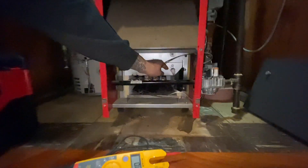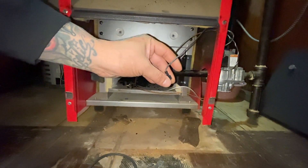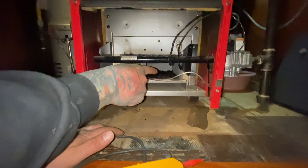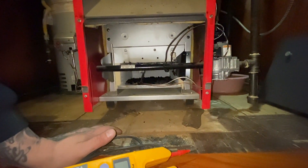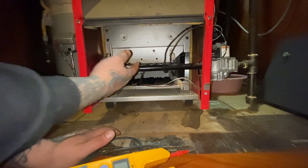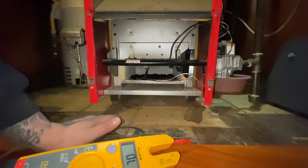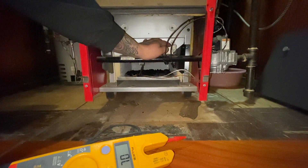Come over here — this is a rollout switch and these are the wires to go to it, they're a little burned up. I'm gonna replace all that. But if you can notice all that soot buildup — that's indicating that we have a clog, dirty burners, lack of maintenance. What happens when you do lack of maintenance is the flame starts to roll out, and there's a fuse here that's burned.